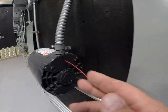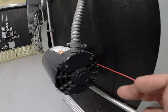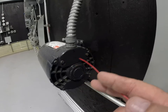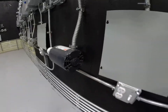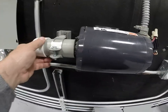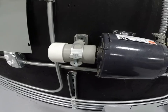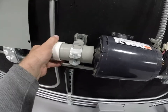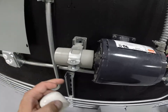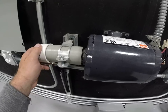And that's what it would look like when all of them are in there with a cover — and you close that little enclosure, sometimes we call them pecker heads. This is the motor control housing for the terminal conductors. Of course, we have a guard on the motor shaft because it's an OSHA requirement, and if we wanted to see what rotation the motor was moving, we would take off this cap, put a piece of tape on, and you'd see the shaft spinning so you'd know if it's clockwise or counterclockwise.